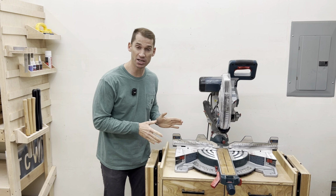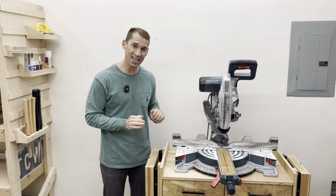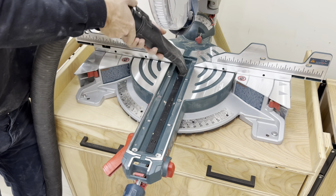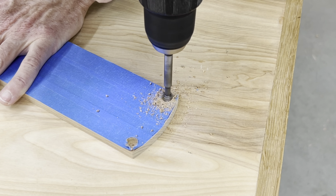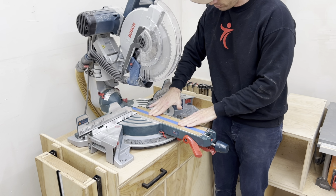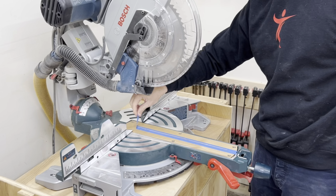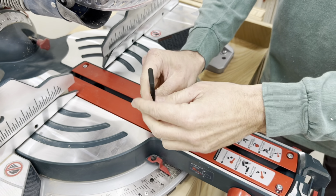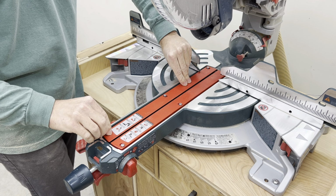As you can see, because of your eyeballs, I made a ZCI for this saw as well, but it was kind of unnecessary. The purpose of a ZCI is to decrease tear out and prevent the teeny tiny cute little pieces of wood from going down into the saw. I commend Bosch for this next feature, and ironically, I didn't even notice the feature until I was in the process of making my wooden insert. They've made their stock plate adjustable so you can actually make it a zero clearance insert.